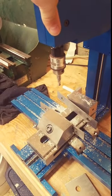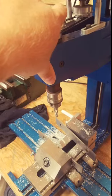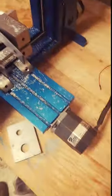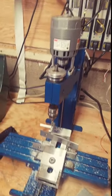So if we could pick up our feed rate, put the chip load on the tooth down to like 1 thou or something, and get our RPM down to a little better measure, I think this would do a very good job. So you definitely noticed a lot of chattering, but once again, that could just been my not having it too tight in the vise. I didn't really give her the beans when I was tightening this down, so maybe that did it. I don't know. I'm still figuring this out. Anyway, so that's that. If you're thinking of a Maxnc 10 for aluminum, totally viable, I would say, just as they said on their website.